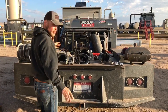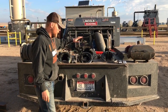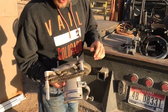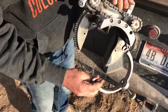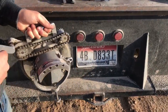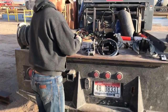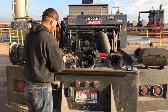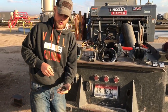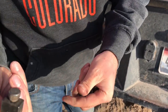Good morning, let's talk bevel machines. We've got two-inch bevel machines here — two to four inch is what they all are, though this one will go to a one-and-a-half inch. This is your H&M bevel machine. The way they latch is they hook right around the pipe, hook it, and then tighten up so it doesn't slide. These are all your dogs right here — goes from two-and-a-half to three inch, down to two inch.